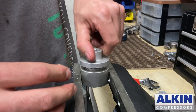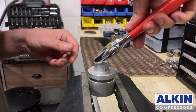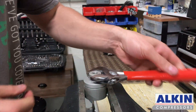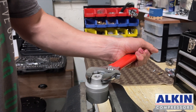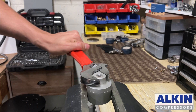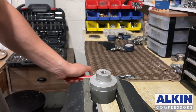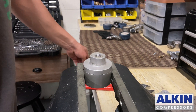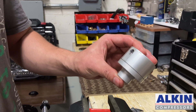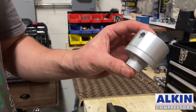All I have to do is close the cap. The trick is when you close it all the way and when it's tight, you have to loosen it up a quarter round. Otherwise, they won't work properly. So a quarter round, it has to be loose. This pneumatic valve is all serviced and it's good to go. Let me know if you have any questions.